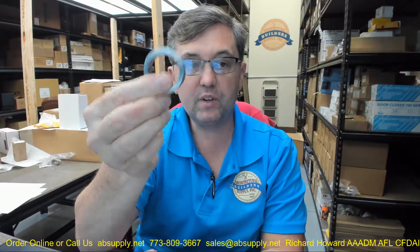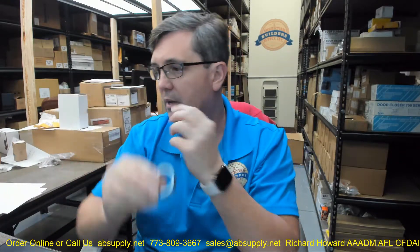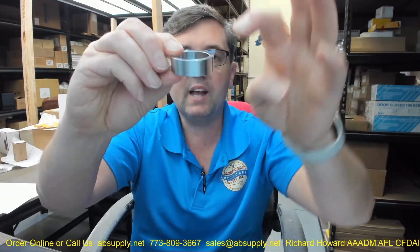There's also a link below this video to a document called technical drawing, where you can review the dimensional properties of the item that we've already gone over. Not much of a chamfer on this to mention, although it is very marginally chamfered, which is typical. They do indicate the chamfer — chamfer optional, both sides. It is chamfered on both the inside and outside.